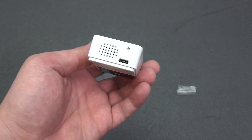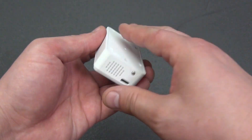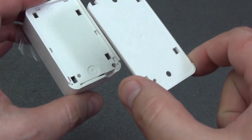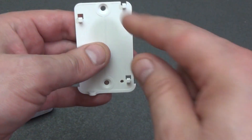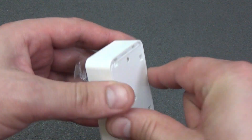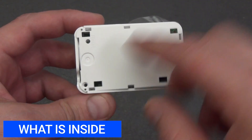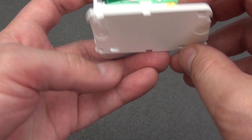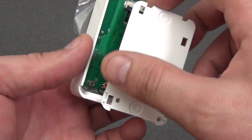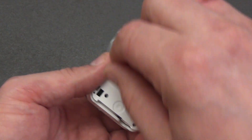Next to the speaker is a USB Type-C port for charging the built-in battery. The battery capacity is 750 milliamp hours, with a service life of about 3 months from one charge — which is very, very good. There is also a small screw at the bottom; by unscrewing it we can remove the rear plastic cover. This trim is secured to the door using the included screws or double-sided tape, and then the intercom fixes onto it via latches and a screw. Structurally, moisture most likely cannot get inside since the board is recessed and the lid closes, but there are no rubber seals or glue, so if the intercom is exposed to rain, I recommend gluing the cover to prevent moisture from entering.